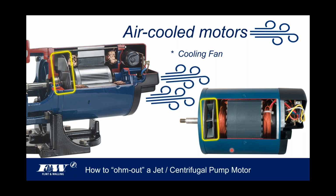And the whole notion of an air-cooled motor is for that cooling fan. Its sole purpose, quite frankly, is to dissipate heat away from those copper windings, to move that heat and vent it right out the back of the motor.